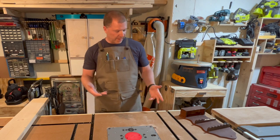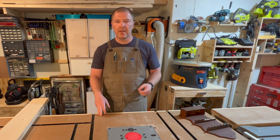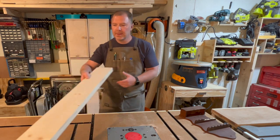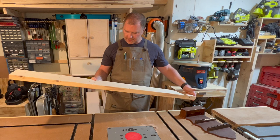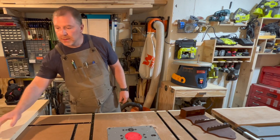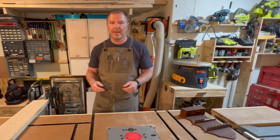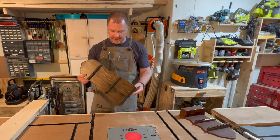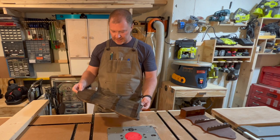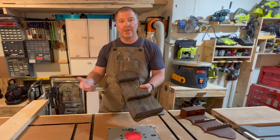I thought I can make it better. However, it doesn't need to be made out of a very fancy piece of wood because it's only going to hold some spoons and be hung on a wall. Pine can work, so we're going to take a board just like this, resaw and plane it, cut it, stain it, and finish it to make it look like this. I'm going to show you exactly how I did every little step of the way.